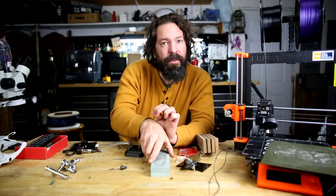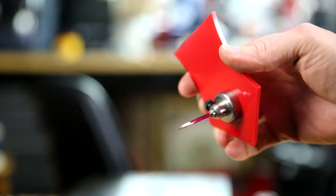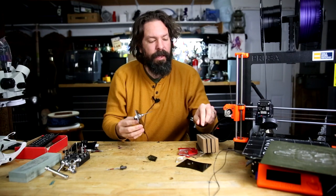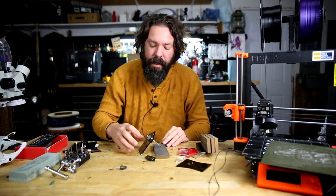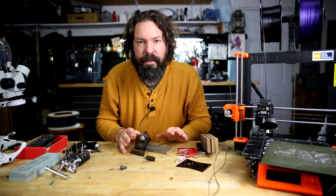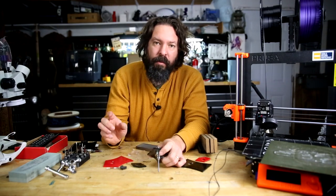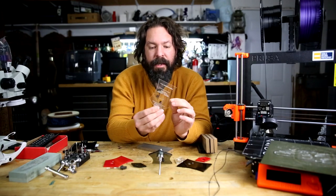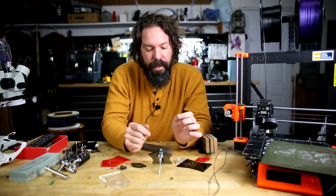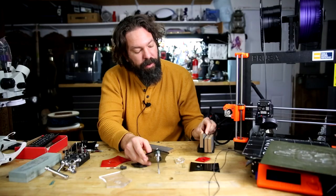What I actually recommend, even though it's a little pricier, is Steve Lindsey's template system — that's what I use. It's a series of plexiglass templates that set the angles for you. You take your graver, slide it in, and use these stones. The acrylic sets all your angles correctly — it's brainless and easy, even though it costs a bit. I believe he charges $40 for each template. If I were to buy only one, it would probably be the 116-degree universal template. However, I bought the whole set and find myself switching around for different things like the detailing one, flat graver, and so on. His set also comes with diamond stones ranging from 260 grit all the way up to 2000 grit.